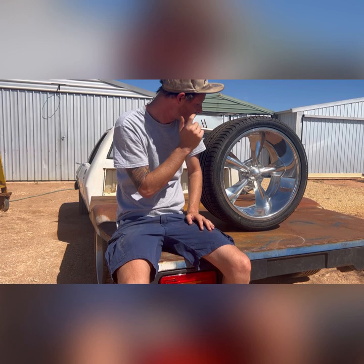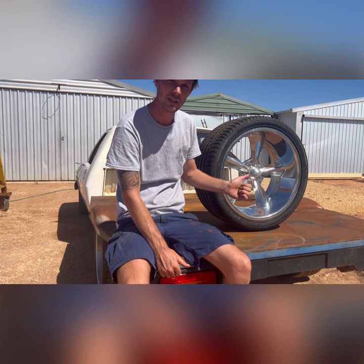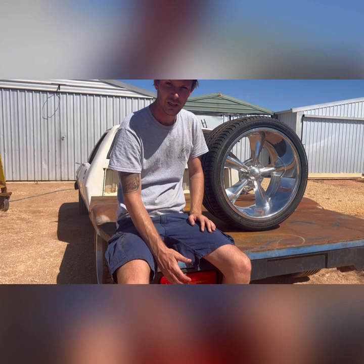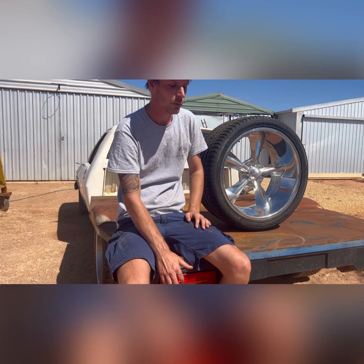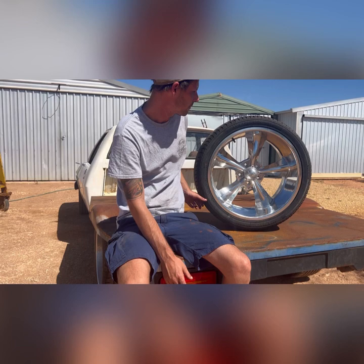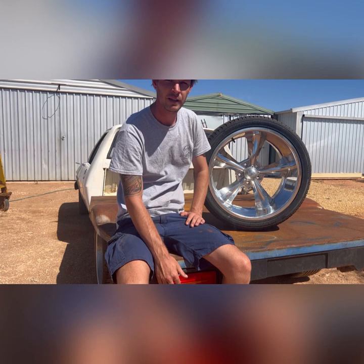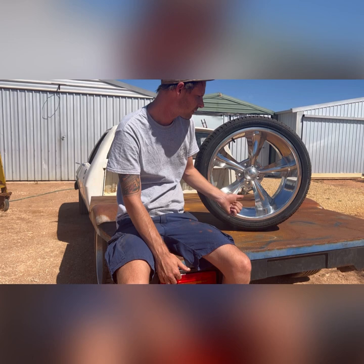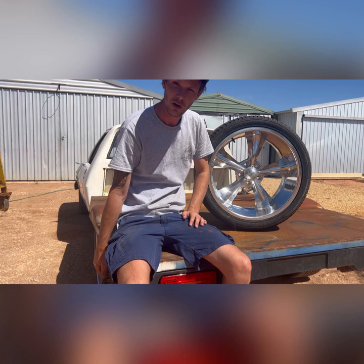This is a 20 by 10 with a 305 tire. We've got five-inch backspace, so it's zero offset — it's a pretty big wheel. I may be changing the wheels down the track to an eight-and-a-half inch wheel with standard or five-inch backspacing. If you're from Adelaide you'll know exactly what type of wheels I'm going to be putting on this car, because it's Adelaide's favourite wheel. The wheel is one of the first things you want to buy before building a tray, because you can only get so far with building the tray until you're guessing clearances. Fairly early on I bought the wheels for this — I knew exactly what I wanted, going bigger from the front to the backs.